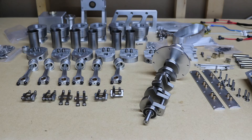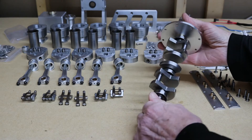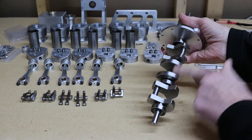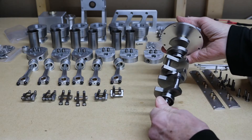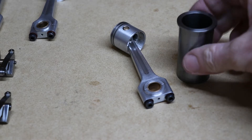It's got two camshafts and overhead valves, and it'll run off glow fuel. This is the crankshaft — each one of these are 120 degrees apart. There'll be two pistons on each one. Here we have the piston and con rod, and the cylinder liner.